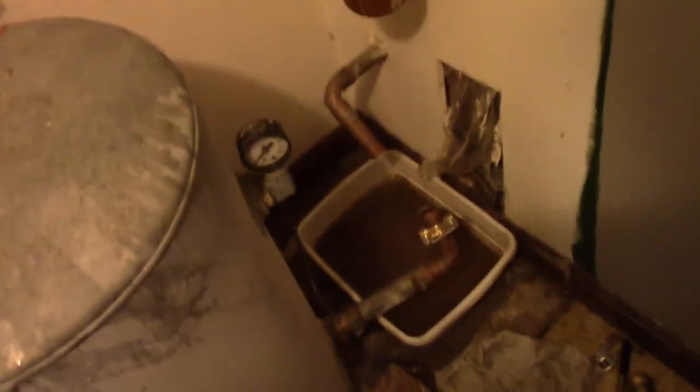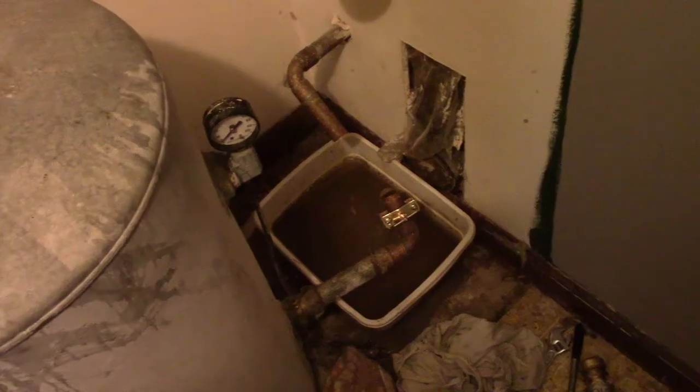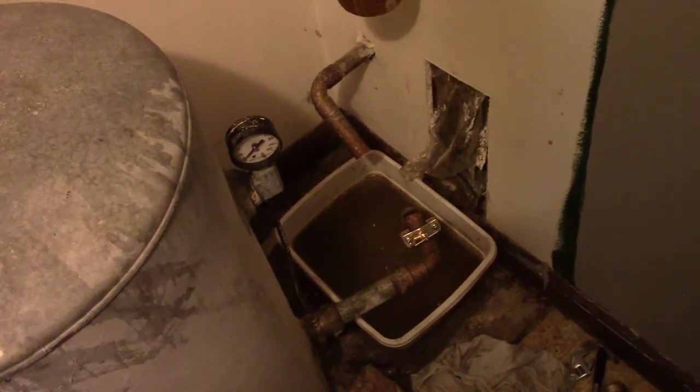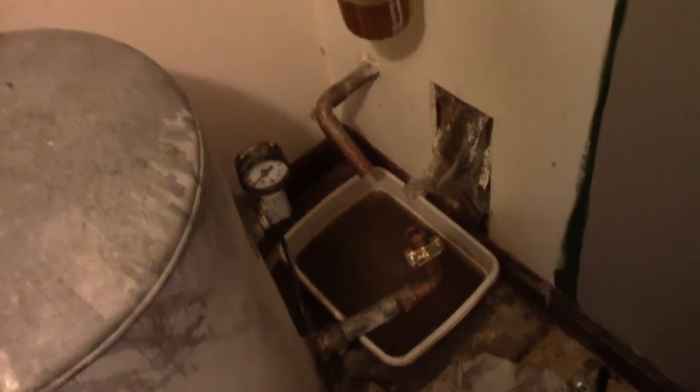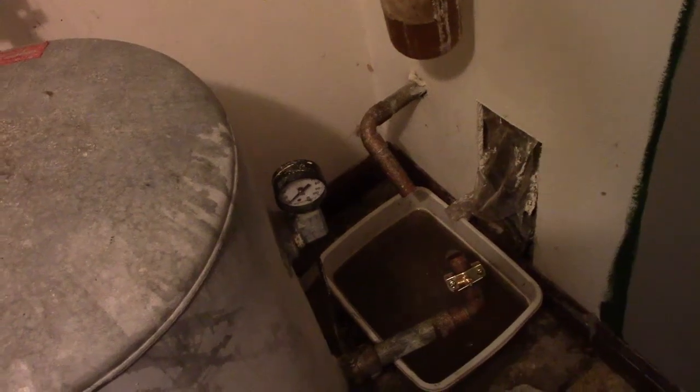I cut before I was ready but I've got my shark bite now. I don't know what that sound is, but I've got to finish cutting and put the shark bite on there — I've got sandpaper to clean it up. Actually, it looks like I'll be able to sweat it — most of the water is coming out of that tank, that's what that funny sound is.